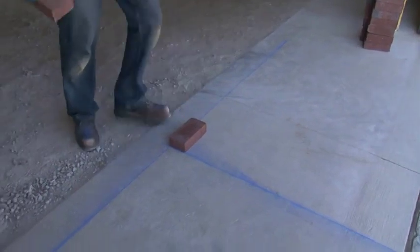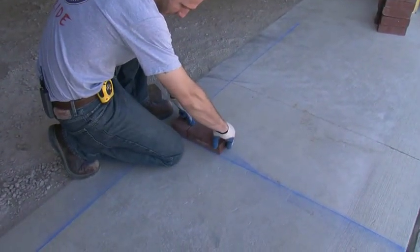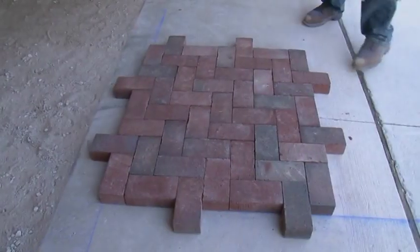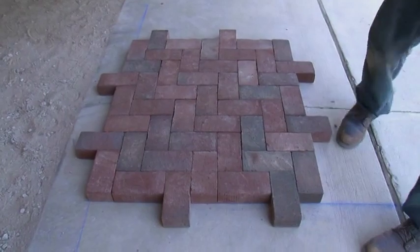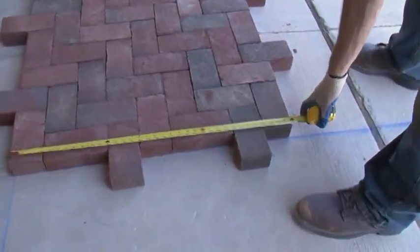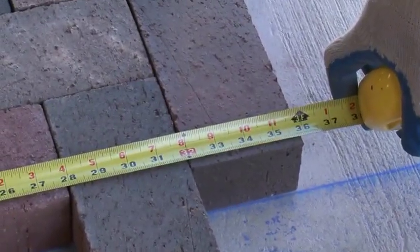Create a right angle and lay out a mockup of the pavers. It is important when creating a module that you lay the mockup in the exact pattern the pavers will be laid. Once the pavers in the module have been laid tight, measure the module. Create the grid pattern using the largest grid measurement, which is 35 and 7/8 inches. This guarantees the grid layout on the bedding sand will allow for straight bond lines.